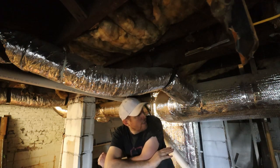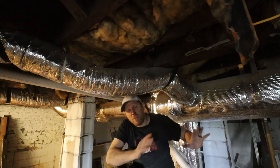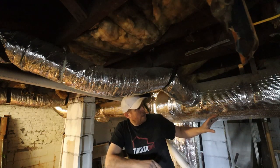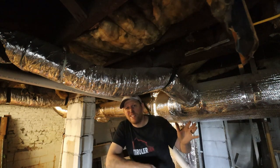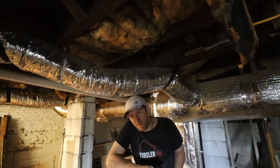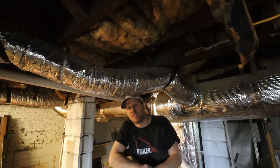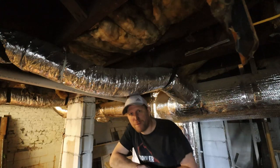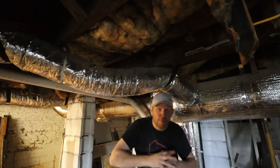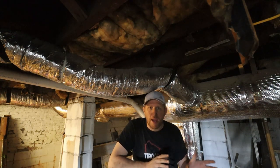They will use rigid ducting everywhere unless really otherwise not possible. And they will probably also do a better job, and you will have an appropriate system, because part of that calculation is sizing the system. And they don't just go with this little schoolgirl calculation of saying, oh, I have this many square foot, therefore I need this tonnage on my AC.